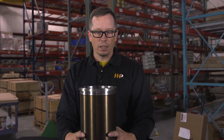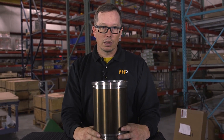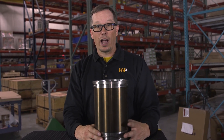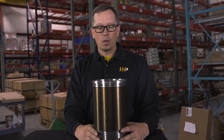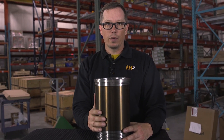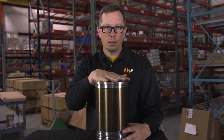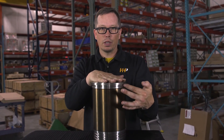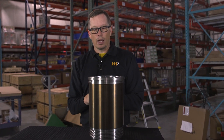Unfortunately when it blows the head gasket, it puts air into the cooling system and the cylinder head severely overheats — and a lot of times you'll find cracks between the exhaust valves on the Caterpillars. To fix that right, you need to put new liners in the block with a perfectly good flange surface, and then have the counterbore cut on the block.